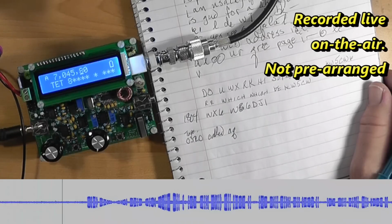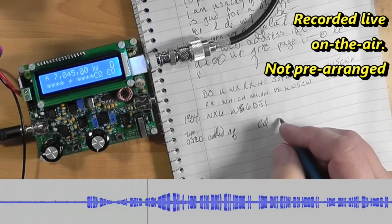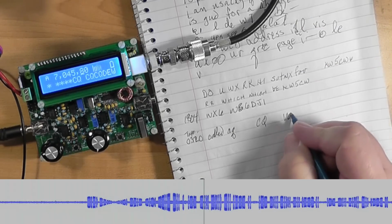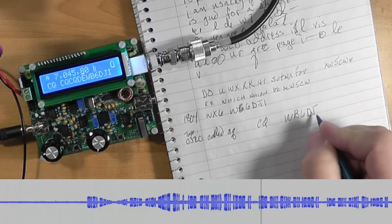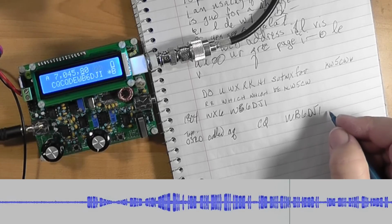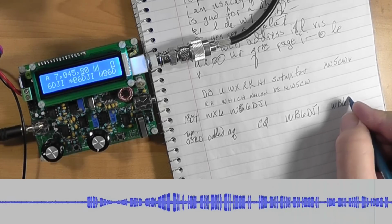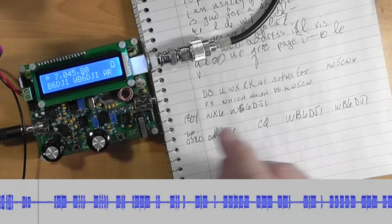I have the radio connected to my 40-meter vertical, and I put the microphone up in my headphones so you can hear both the incoming signal and the keyer itself, what they call the side tone. It's actually very carefully constructed to be on the same frequency that we would be hearing. So if the side tone matches the incoming frequency, it's in good shape.